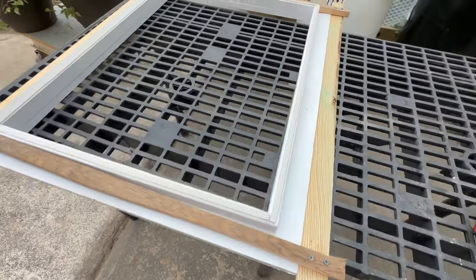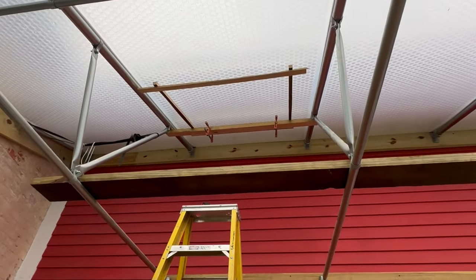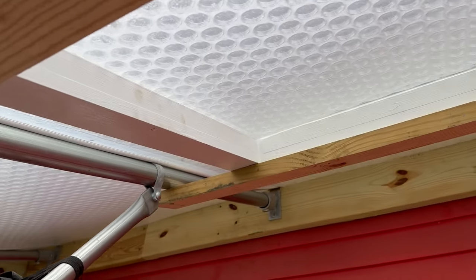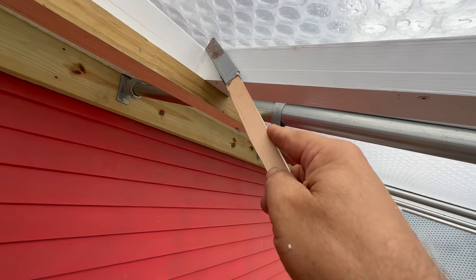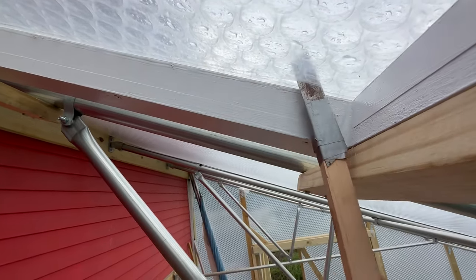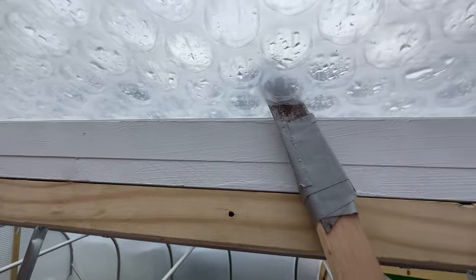Now with solar wrap, when you are going to fit a roof vent, this means you're going to have to cut a hole in your very precious bubble plastic. I've got the base of my vent and I made a template. You can see me setting it up so I know exactly where I'm going to start cutting — and obviously you can only cut once. So take your time, get it level, get it in the right place, and make sure it's square. Be absolutely sure that you're cutting in the right place before you pull out your knife, because this is plastic and once you cut it, you are committed. I've learned the trick of cutting on the inside face — this means I've got about a half inch or three-quarters extra for a nice tight snug fit. A sharp knife is imperative, and I cobbled together a long-handled arrangement that helps keep it nice and accurate.